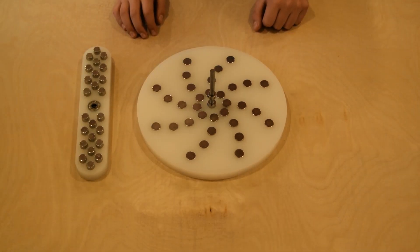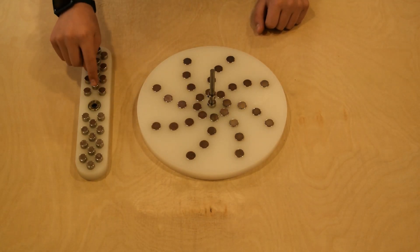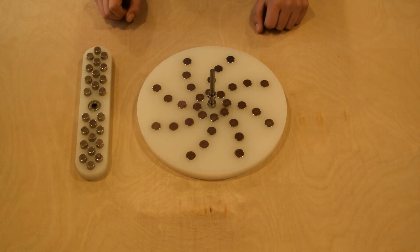The configuration on the rotor as of now is north-north-south, north-north-south. In the case of an electromagnet, it can be turned on and off when needed. In the case of a permanent magnet, the timing is created by the strategic positioning of the permanent magnets. Some will be in attractive mode and some in repulsion mode.